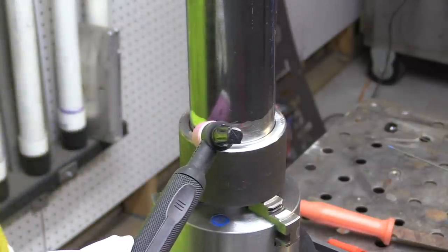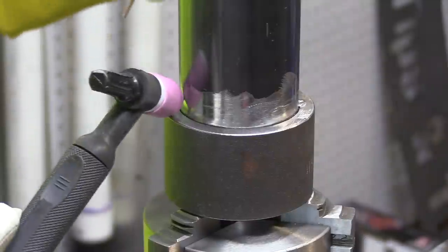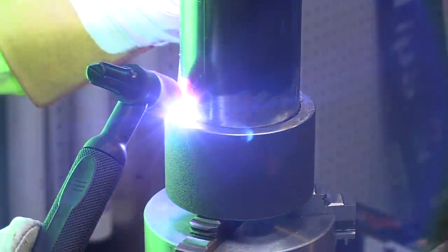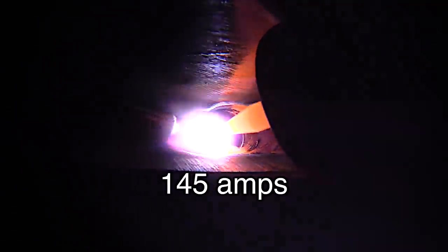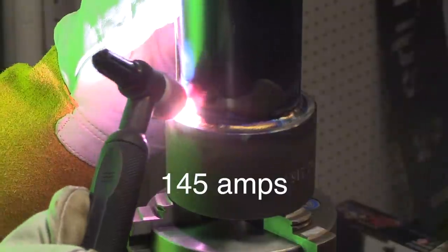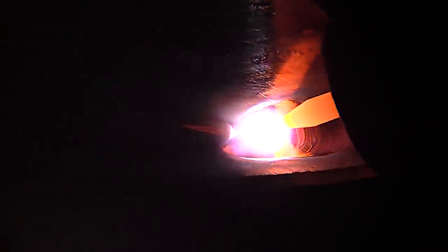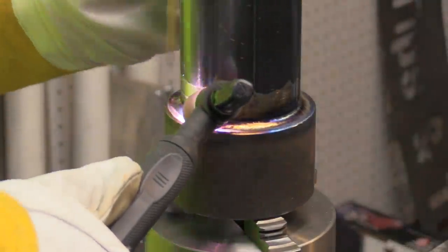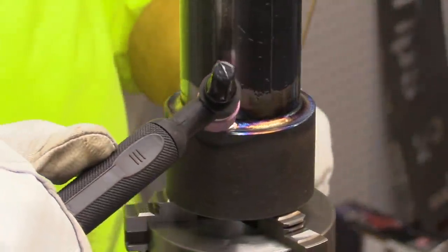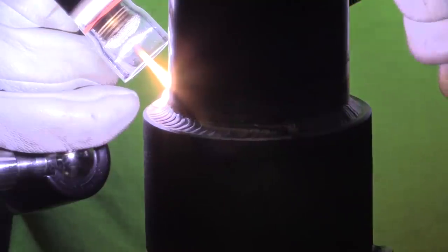Let's do a little technique called walking the cup. You don't need a prop for this — I've done parts without a prop and just walked the cup using a turntable. It worked out pretty well. For this I think I'm using a number seven cup, and that really matters — if you use too big a cup you can't wiggle it well; too small is a problem too. A seven cup lets you get the right electrode angle and lets the cup wiggle along nicely. The size of the weld or number of passes is going to be determined by drawing, code requirement, or customer requirement. I'm going to put multiple passes on this today for the sake of the video.